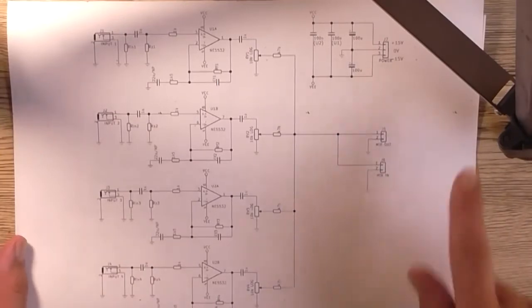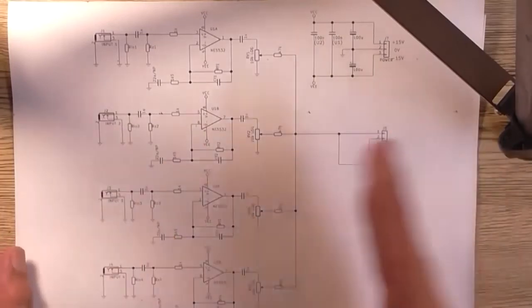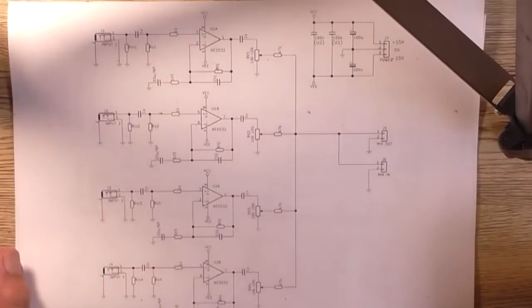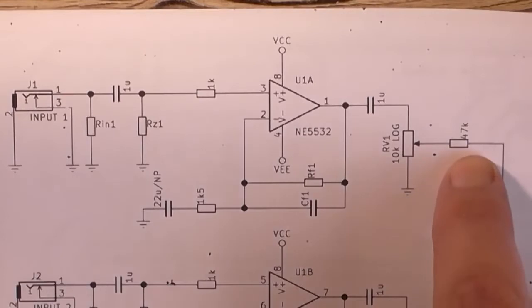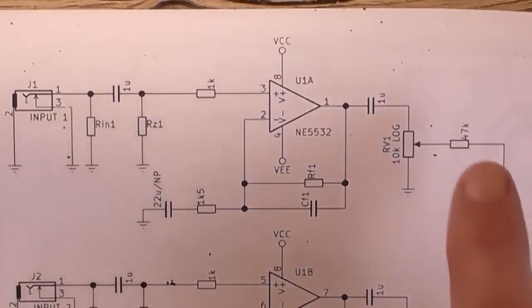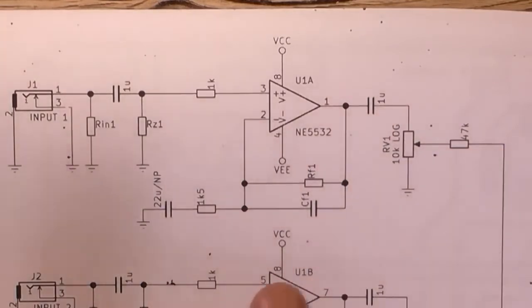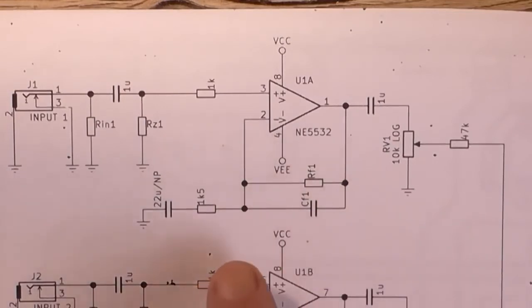There is more circuitry over here for the actual mixer preamps and tone control stage, but it's not presented here, as it's not relevant. So here's one input stage, the 47k mixing resistor here, and there's three others down below here joined to here to form the mixer. So it's pretty much the same as the first video, nothing much has changed.